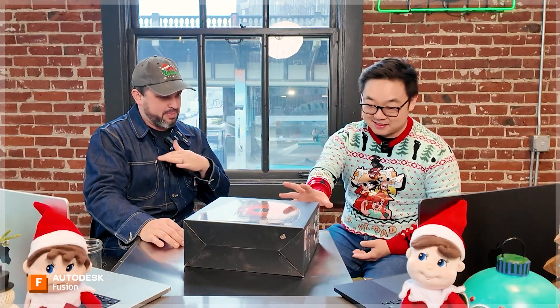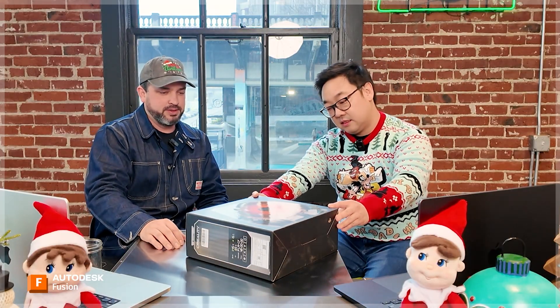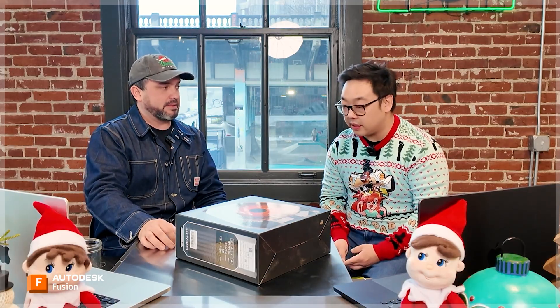Right now I just dry filament in my closet with desiccant packs everywhere and wait overnight. This is a nice way to just get it back to zero moisture. Everything you can do to get your filament as dry as possible is going to give you a better result — especially if you're trying to do something that really needs to be durable. The drier it is, the better the performance is going to be.